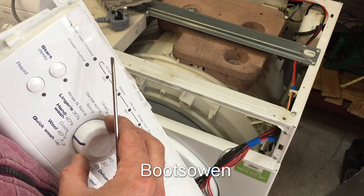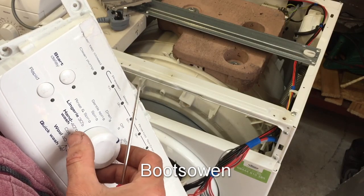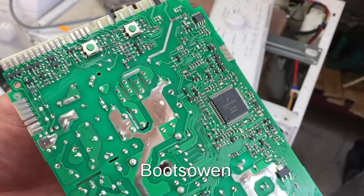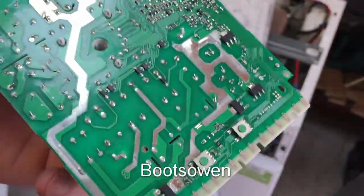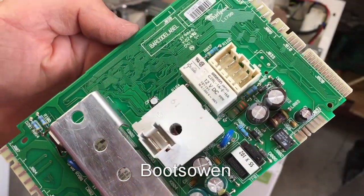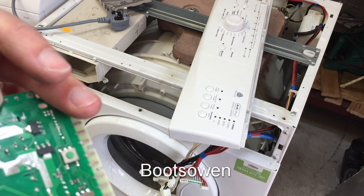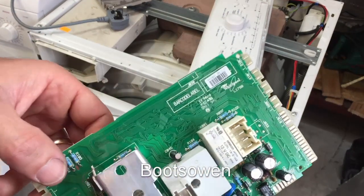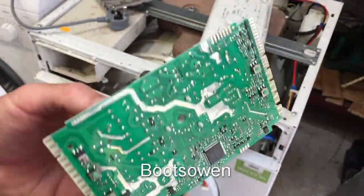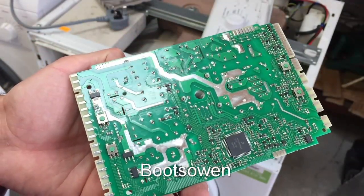Playing with the switch, it does seem to be working — it only has points at each of the nodes and there's a proper click. I do wonder what that could be. There are no signs of any arcing, blowing, smoking, anything like that, which is what I'd normally look for. There's a bit of a bad trace of solder down there, but that's not the end of the world. It's a double-sided board with traces on both sides — maybe the lives on one side and neutrals on the other, or some combination.